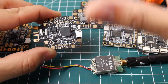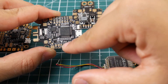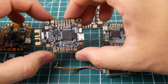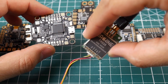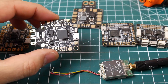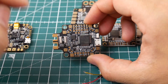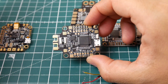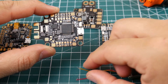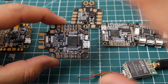That signal then transmits down to your goggles. Now powering the VTX is sometimes a little tricky but it's very simple. This board doesn't have anything more than a 5 volt regulator, and this is a 7 to 24 volt VTX, so we take the red wire and power it directly from the battery. So the camera is plugged in with 5 volt, ground, and cam wire; the VTX yellow wire goes to the VTX pad, black wire to ground, and red wire to the battery. That's it - just that easy.